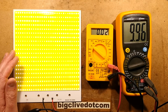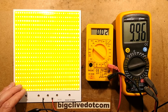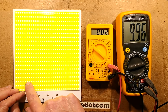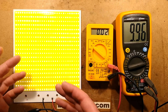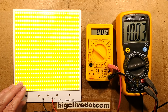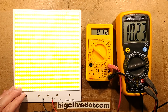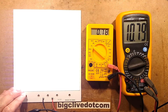We've got about 20 milliamps and at that level there's a slight pattern in the LEDs. They're mostly lit with a slight variation in color — some look greeny colored while others look blue, which is probably just the reaction of the phosphor and differences in intensity. This kind of rules out using this anywhere near 200 watts, because the current mismatch of the LEDs will be horrific. Let's bump it up to an amp.